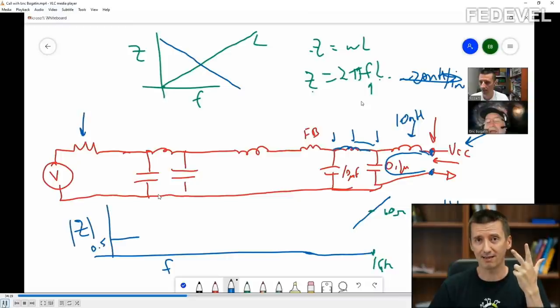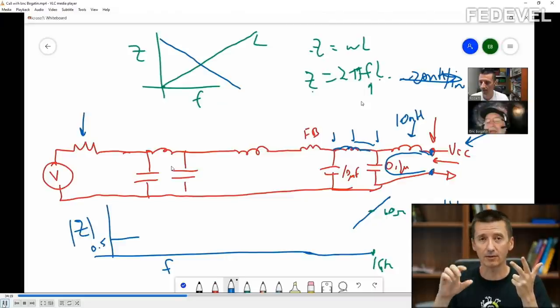So 3 big things what I learned in these 8 minutes is this kind of circuit for power delivery is very important. I was always looking wrong at the power delivery. You have to look from the pin this direction. And the inductance of the tracks, even very small inductance inside of the capacitors, non-ideal components, is very important, because this small inductance is going to influence the power delivery in your boards.